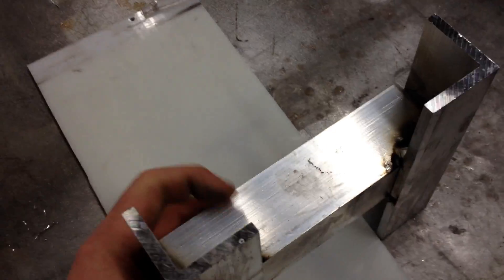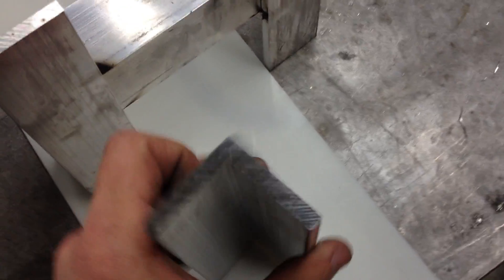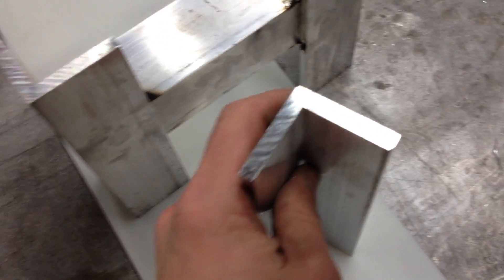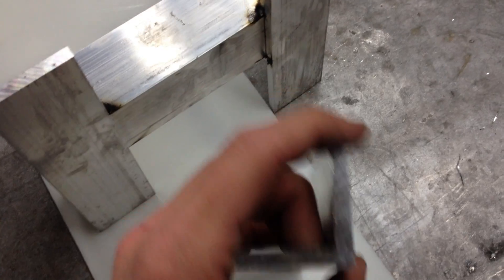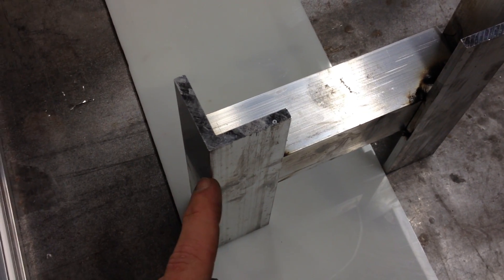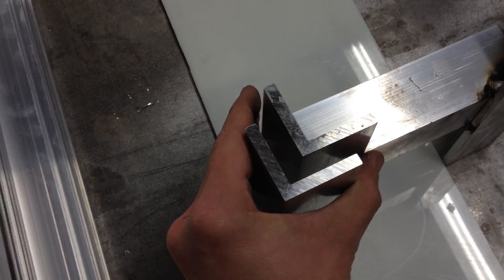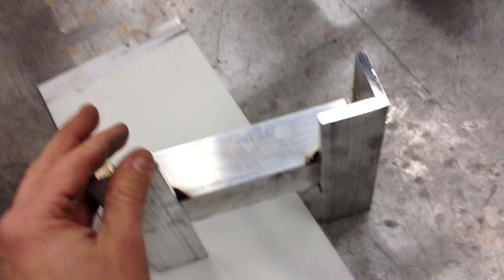I've done this before with an exterior mold where the acrylic or Lexan sits on the inside curve, which gives a nice gentle bend. But I don't want to put any pressure on the corners of the pouch cells, so I want a much sharper interior edge on the bend. I'm going to try using this jig on the inside — with a nice sharp edge — then clamp a couple of pieces on the outside and squeeze it into place. With this making the interior shape, I can control exactly where those bends are.